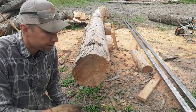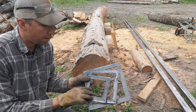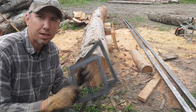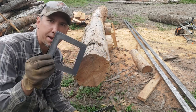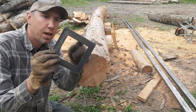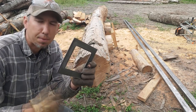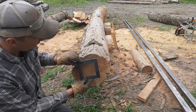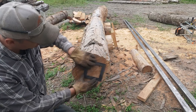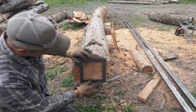Alright, let's get our log set up. This is the small end. I've made these jigs for myself because I like to cut beams. I have a 4x4, a 6x6, and an 8x8 jig, and the inside dimension is the dimension of the rough cut beam. So this is 4 inch by 4 inch inside, and the outside gives me enough room to screw on my bar holders. You can take these jigs and set them up inside the small end of the log. On this one I can get more than a 4x4, so we're gonna try for a 6x6.